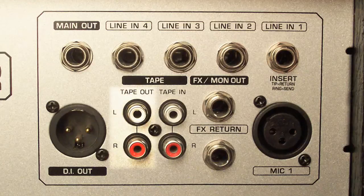To the right of that, we have the tape-out, which is a set of RCA connections that supplies the audio signal of your KX-1200 to a recording device. You can actually run an MP3 player using a simple RCA to 1/8-inch Y cable — just plug that into the amp and you can run your tunes through this great-sounding amp. To the right of that, we have the tape-in, which allows you to connect an external machine such as a drum controller or an iPod or any MP3 player.